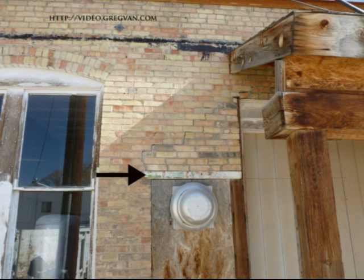We also have the post supporting a wood header. Any type of shrinkage in the header or the post could cause the brick to settle. Remember, lumber shrinks. If it's completely dry when you install it, there's a good chance it will not be shrinking, but that's not a common practice in construction.